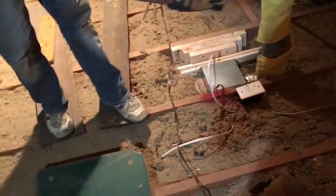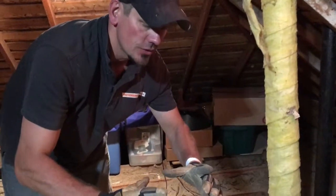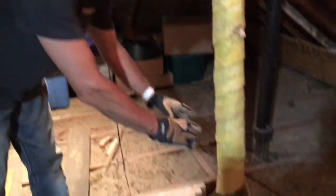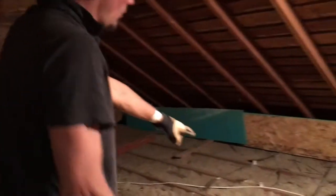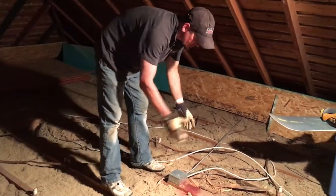So we hit that light fixture, this junction box — and keep in mind, I'm going to suggest for her to use one of those funnel tubes, basically the 12-inch or 6-inch ones you use when you're doing a pylon digging for your pergola or deck — I'm going to ask her to put one over that so when they insulate you can see down to the junction box. I also sprayed the ceiling with red above and red down so she can explain to the general contractor that right over here there are a couple more splice boxes, marked so we know where all six of them will be accessible.